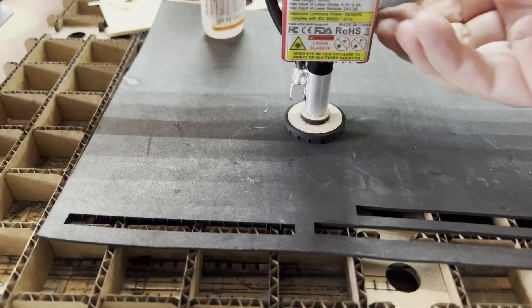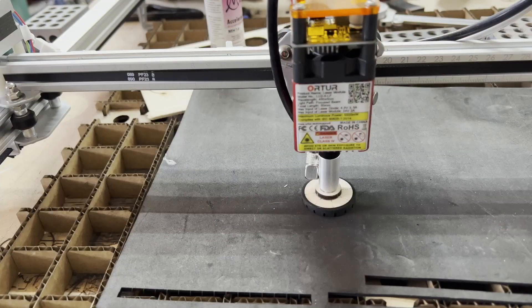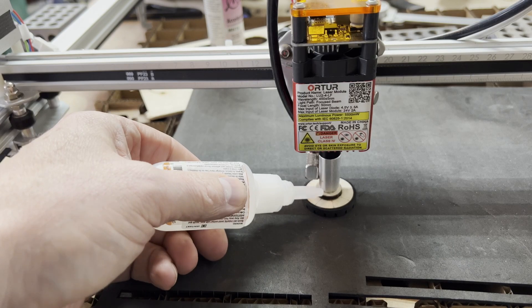Optically, not the best, but better than before. It reduces your need to build a giant enclosure. I think this should be one of the first things that you laser cut and glue onto the nozzle. I just glue this thing on with CA glue. People are going to think that it's permanent, but the fact is CA glue sort of sticks to aluminum, but not really that well. So if you glue the puck on there, it's really not that hard to break it off. You clean off the CA glue residue and you should be fine.